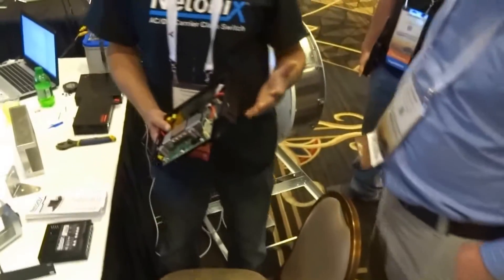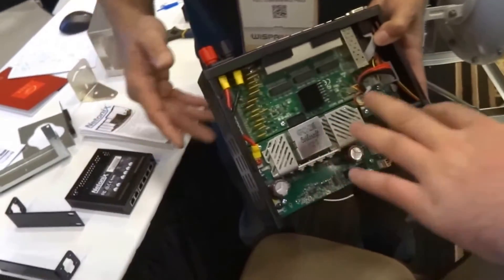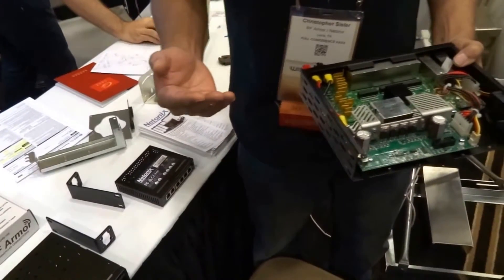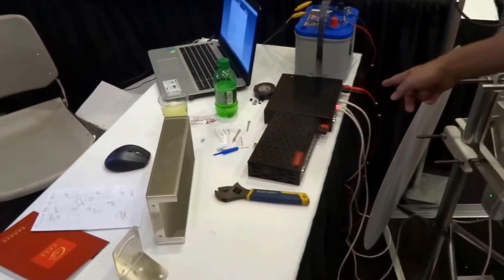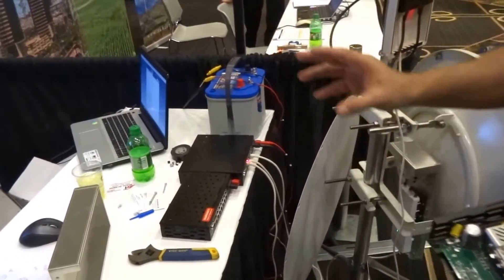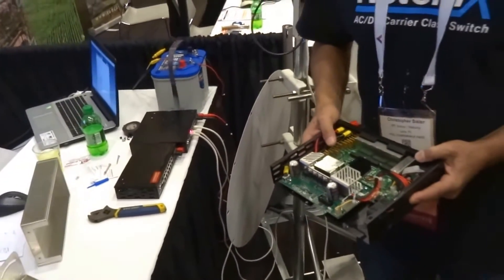There are a lot of firsts. And then our DC switches — what we call the Smart DC. When we say smart, we're not referring to the switch capacity but the power. Our Smart DC can be fed from 9 to 60 volts in — it doesn't care — and still power 48 and 24 volt devices. So you have a built-in voltage regulator. We designed this power supply — it has its own Texas Instruments microprocessor and its own firmware, so it's constantly monitoring the input voltage from the battery banks, telling you how much efficiency the conversion is achieving. This one here is hooked to just a single 12 volt battery, but it's outputting 48V high to power the mini switch, which is powering radios, and also powering the Air Fiber 5X — all from a 12 volt battery. You can feed it 12V, 24V, 36V, 60V, 9V — it doesn't care. You can program it to give warnings when voltage levels reach certain thresholds, shed PoE load to conserve your batteries, or set time conditions to turn ports off at night when you don't need the power, giving you a longer run time.